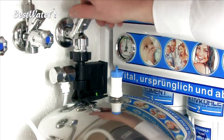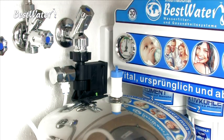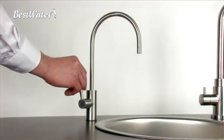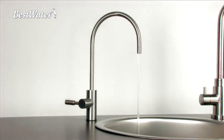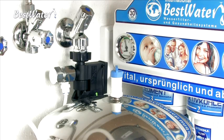To start the service you must stop the water supply to the Jungbrunnen 66. For this purpose please close the service valve. To relieve the pressure in the system open the water tap. The storage tank is emptied thereby. The discharge process can take up to 15 minutes. You can watch the decreasing pressure on the pressure gauge too.